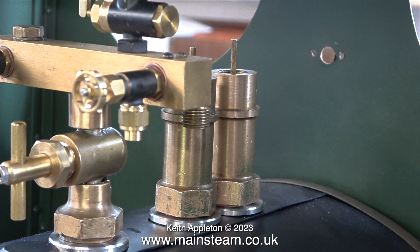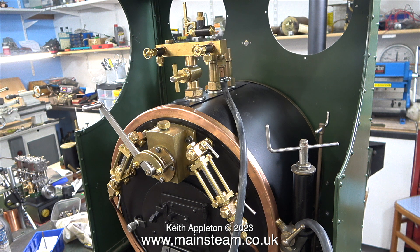I'm not going to fit the pressure gauge yet, just in case I damage it. It fits on the rather coarse thread which points down at the right-hand side. This is a BSP — British Standard Pipe — thread, and I'm going to use it to temporarily connect the airline to the boiler so I can put some air in the boiler and check for leaks.